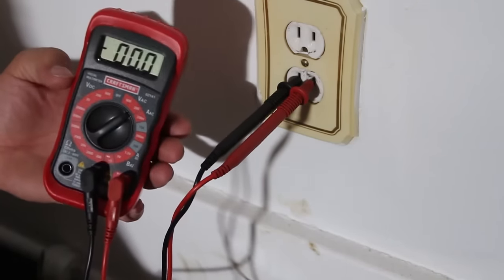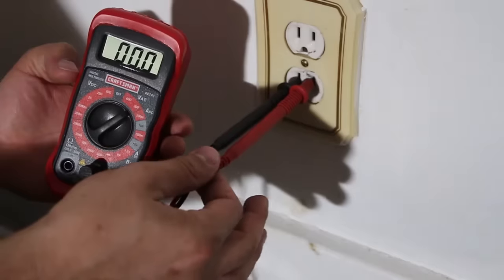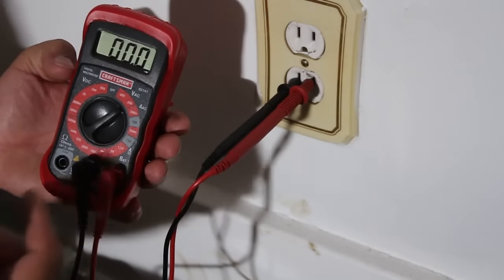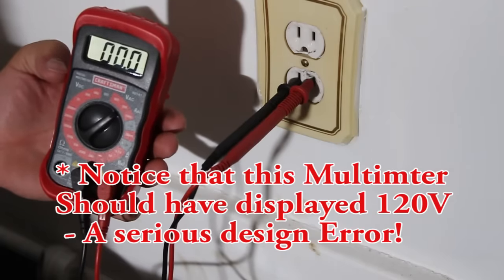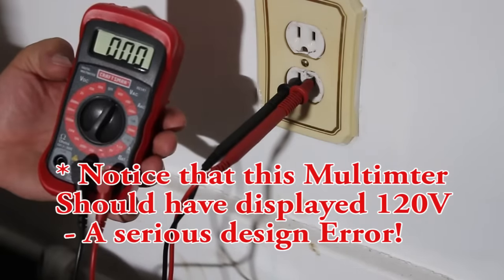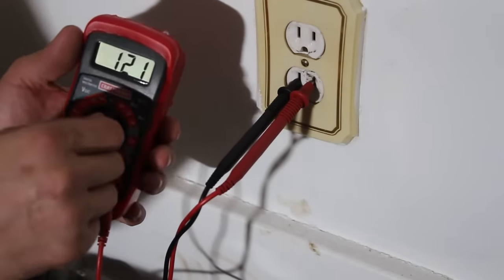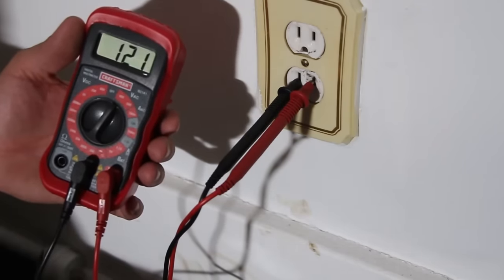Knowing that people are going to probably use this to measure AC power of outlets, electrical receptacles, I think this was, again, a bad design on their part, because a lot of people may assume, hey, it's 120 volt, this is 200 volt, right? It's greater, it should show, but it doesn't. Be very careful. Go up one more if you're not sure. Maybe worth getting one that maybe is mid-range, one that automatically selects the voltage so you're not guessing or you're not playing with it. So if on the safe side, always go a little bit higher